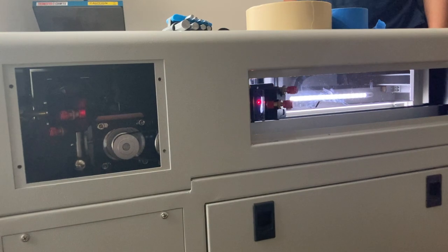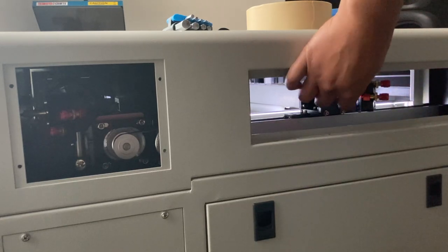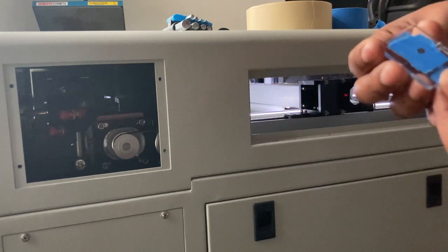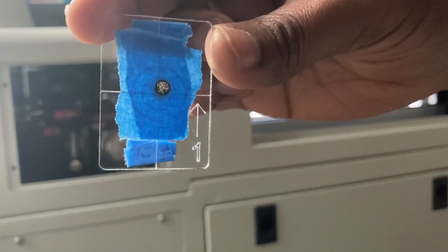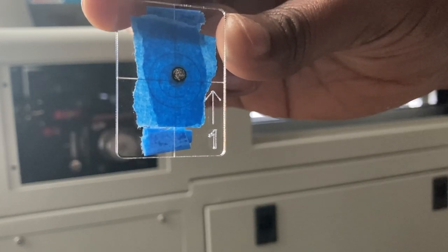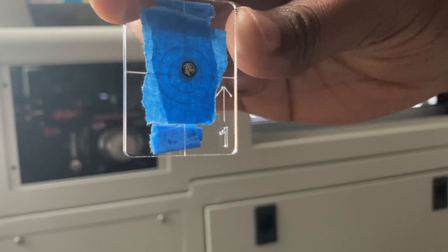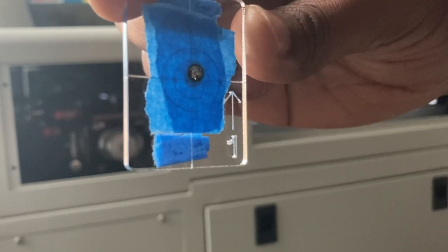I pulsed in first position — the pulse is very quick. I moved the gantry to the middle to access and remove the acrylic target. The target shows two dots dead center, right on top of each other. However, they're up and to the right a little — you want them in the middle of the target. So we need to bring it down and to the left. Let me show you how to adjust.